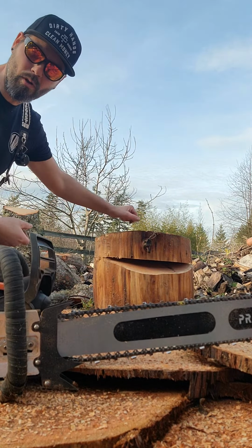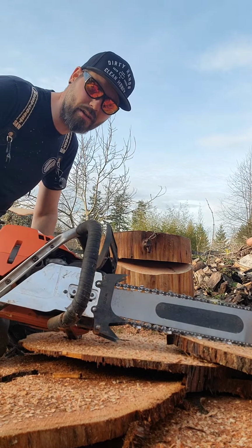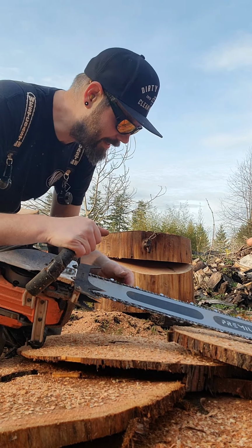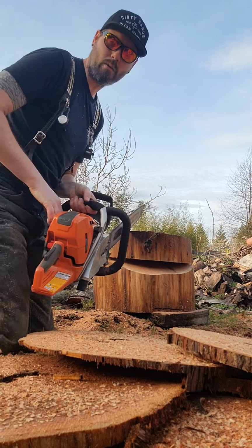You know, sometimes if you're pulling away from the stump, you'll be part way in the tree and you'll have the saw resting in the cut and you're snipping some fiber off as it goes. You're gonna kick your chain off. So, yeah. I'll have to loosen it to get it back on, I think. Oh, maybe there we went. I don't like that.